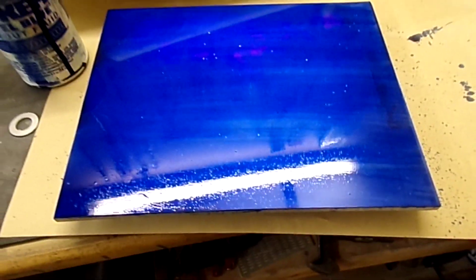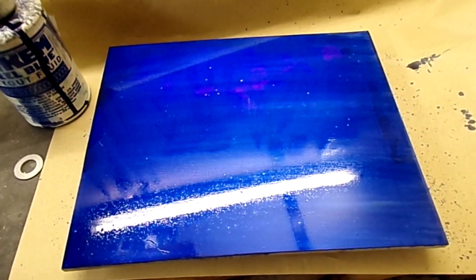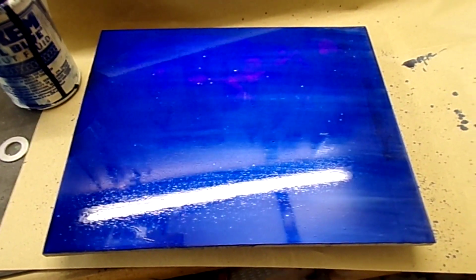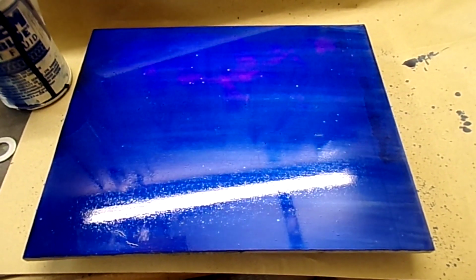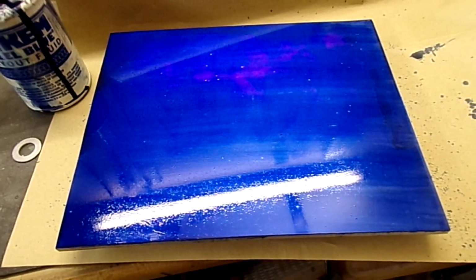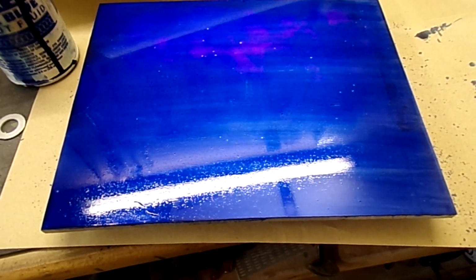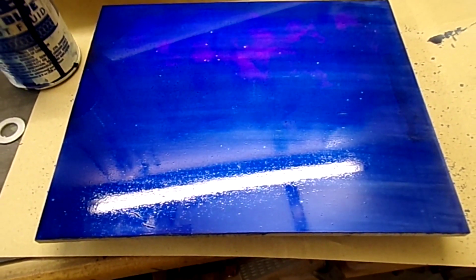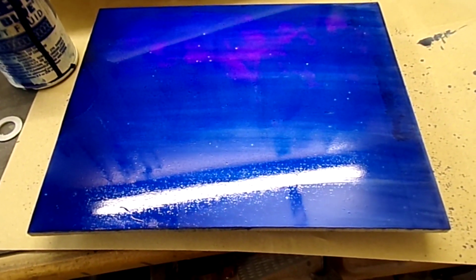Okay, so the marking blue applied to the plate, 1/4 inch 6082 T6, which I'm going to use to make up the replacement top plates for the Cabane Struts area. And this is a lot. Well, I'm making them bigger to make sure I've got the edge distances, and I may end up trimming them down later to get rid of the excess material.